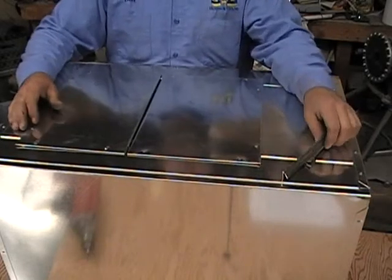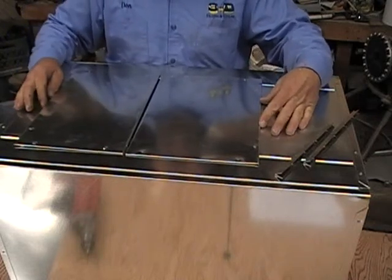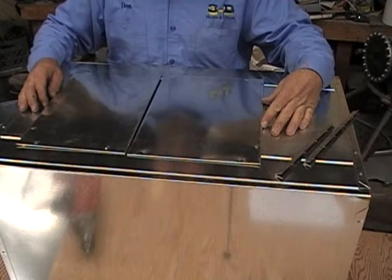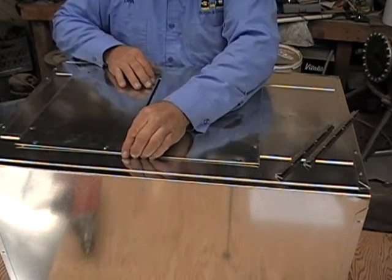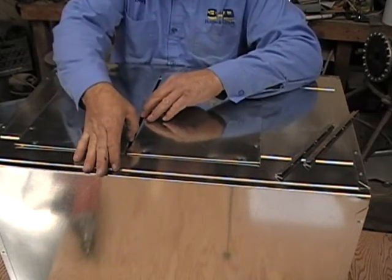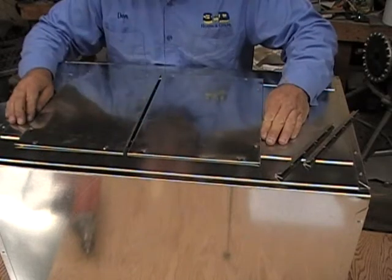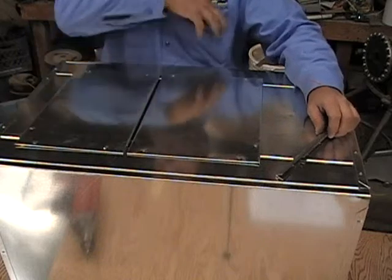Now in lining up the doors, there's about a half inch of play in between here, so you'll want to put it right about in the middle. With these doors you don't want them to accidentally hit, so space them just a little bit — right here I'm at about a quarter of an inch. Mark that.